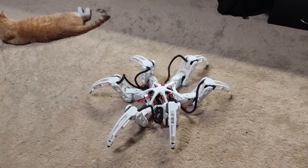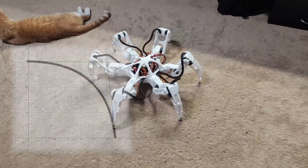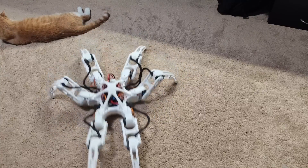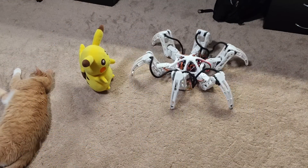But while doing that, I may have ended up completely changing the slam, which was now a body slam — or more like a belly flop. All I had to do was change the slam curve to reach farther out and then make it stop before it went below the body. I fully admit the previous one looked way cooler, but slamming the legs into the ground like that would have been way too hard on the servos. I wasn't really happy with how it looked, though — the outstretching of the front legs into basically just falling looked kind of lame. But I realized I could still slam the legs down; I just needed to stop them from going below the coxa. I changed the slam curve from the outstretch back to a slam while still making sure it didn't smash into the ground, and it looked so much better. The servos should be safe. The floor, on the other hand, is another story.